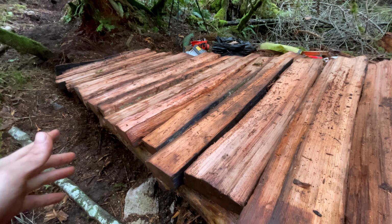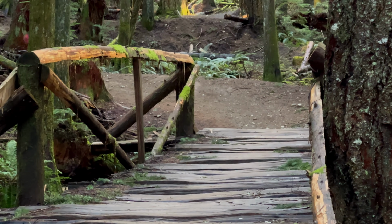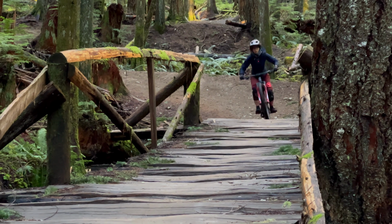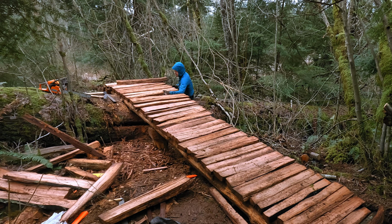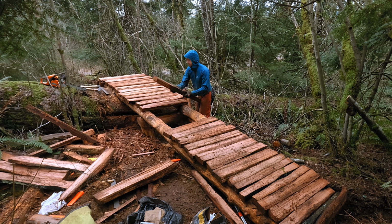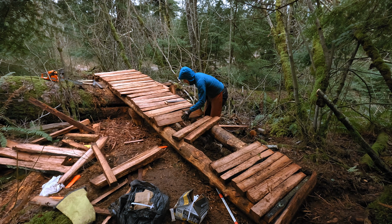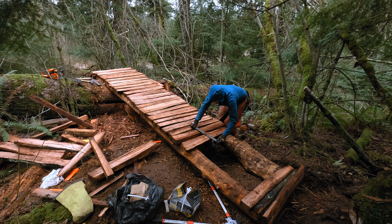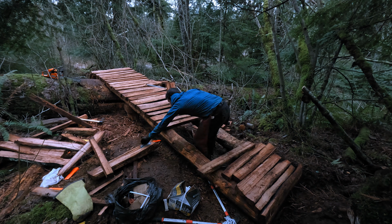And if I just move that to one that's a similar size, it's going to really smooth out the bridge. There are a few bridges out there that just sap your speed and shake the fillings out of your teeth. This is often avoidable if the builder just took a few minutes to organize the rungs before nailing them down. And with less vibration running through the bridge, it probably also helps the longevity of the structure. So with my rungs organized properly, I nailed them down until sunset.